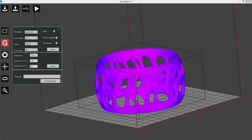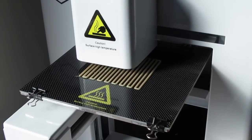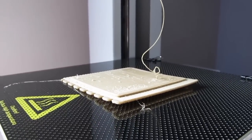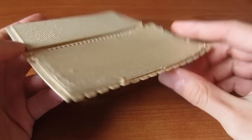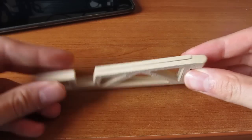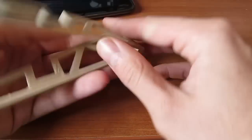With PLA, sometimes at the beginning of printing, the raft line was occasionally pulled upwards by the extruder while moving to another point — one reason why we mostly used the slow setting for printing speed. The most annoying problem was objects flexing off when using wood filament, mostly on the bottom raft construction. This was partially avoided by raising the bed temperature to its maximum of 100 degrees Celsius — usually around 60 degrees for PLA — but in the end that also didn't help with larger surface objects, so we mostly used PLA filament.